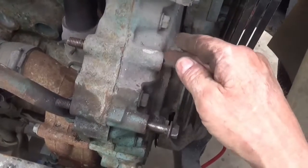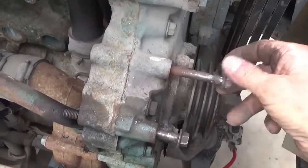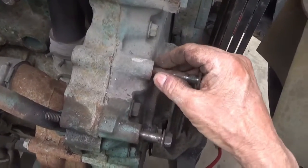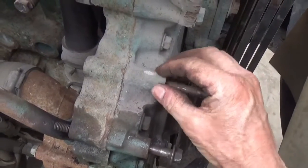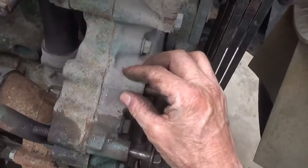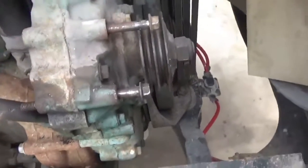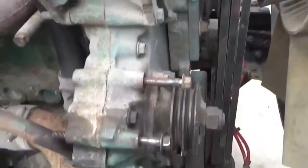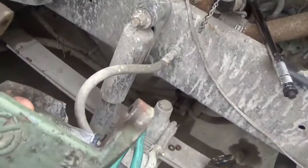What I am going to do is grind this down smooth. But before I do that I'm going to go up to the hardware store and get some new bolts and some grade eight washers — I've got plenty of washers here but I want grade eight because I don't want the washers to wear down thin while this stuff is wearing down. I want the washers to be tough. I'm going to go get that stuff, come back, take measurements, get the grinder, and start making this thing fit tighter.